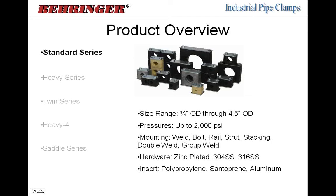It works the opposite way too — the heavy series has higher pressure ratings, but you may also choose it for a low pressure application. For example, if it's inside a mine where rocks are going to fall on it, or on a drill ship where even a low pressure line will see roll, pitch, yaw, and other forces and moments. You may want heavy series even though operating pressure is low — so this is your starting point.